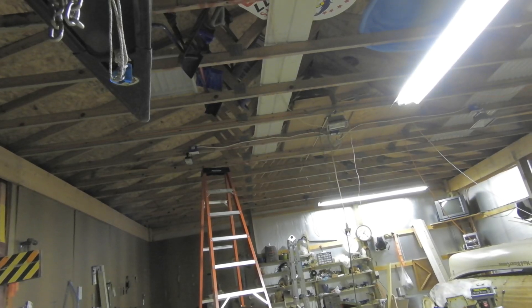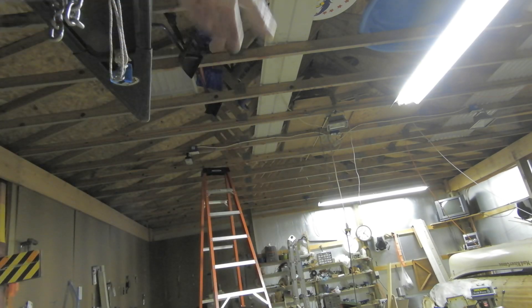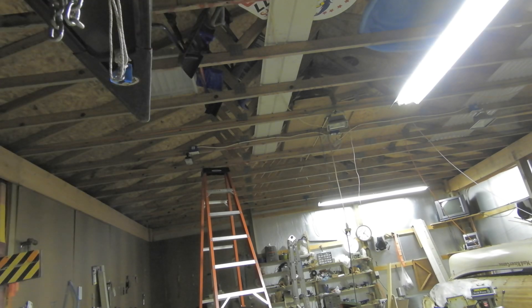She's bright though. Here's my barn ceiling — I've got two circuits on. I have three switches: one controls the outlet at the far back, one in the middle, and one at this end. I've got fluorescents plugged into the front and back sockets, just as it was originally done. I started switching to LEDs because the fluorescents don't work well in winter — they take a while to reach full brightness, and the one in back was flickering even in the 60s temperature.